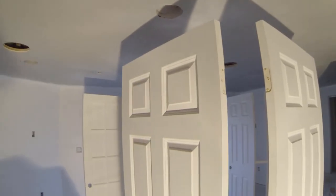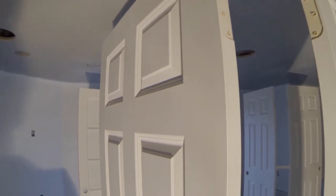I'm actually going to do the top coat on the doors while they're stood up like this so I don't have to move around and do this again. That Bullseye primer sprayed on really well — I hadn't used that before. Here is the door after it's dried and as you can see it just really laid on nice. From start to finish, moving the painter around and everything, it probably took me an hour to an hour and a half to do the entire basement. The doors maybe took 15 to 20 minutes. I'd say I got about two hours of actual spray time doing this entire basement. It had zero issues, wasn't streaking at all. I was able to dial in the pressure and it liked that primer a little bit better than the gray. It laid on real flat and smooth, so I'll do a little bit of sanding and we'll be good to go.